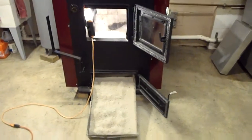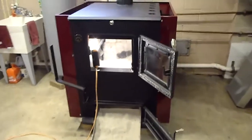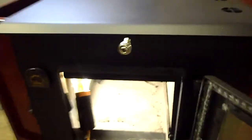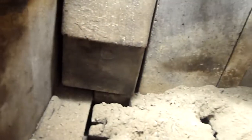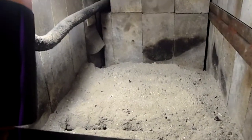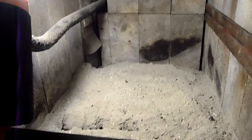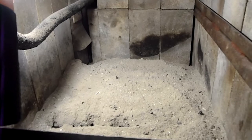Just wanted to show you a little tip. What that'll do, if you have a grate system or if you don't have a grate system, is that you'll have a better controlled fire, especially in the DS stoves or any stove with an ash pan or grate system. It'll actually go through the louvers — you can see they're clean from any obstructions. I'll load my kindling in here and my paper and a few little logs and start her up, and I'll have a good base already to work with so I don't have to worry about trying to build up an ash base.